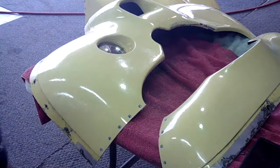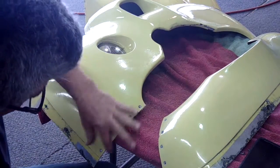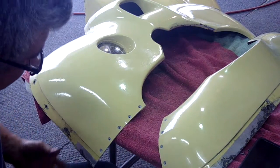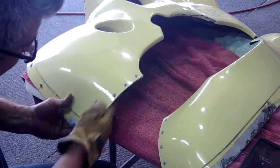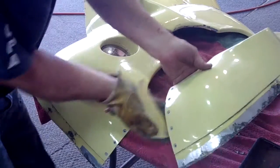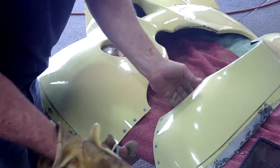As you can see, we've now separated the nose bowl into two pieces. Before we go ahead and start putting the fasteners in, put on a glove because it is fiberglass. We're going to come back with a piece of 400 grade sandpaper and just break all those glass fibers and get a nice smooth on all the edges. We'll do that for all of them, then we're going to be riveting in the plates. Stay tuned, more coming.